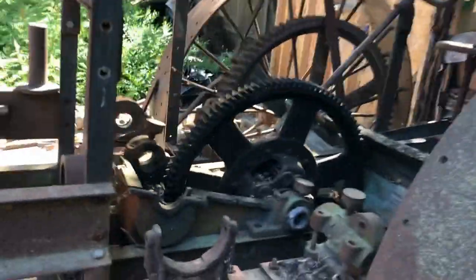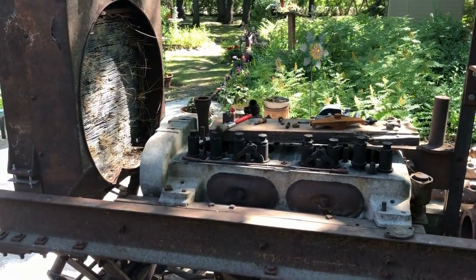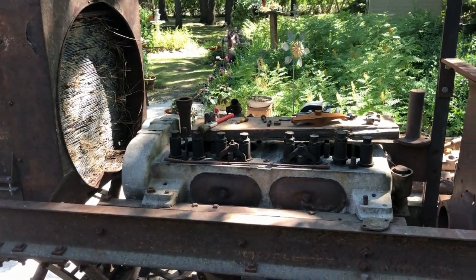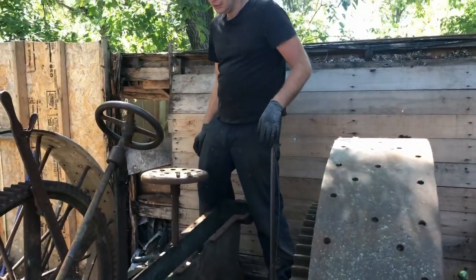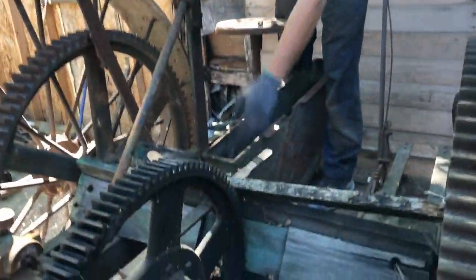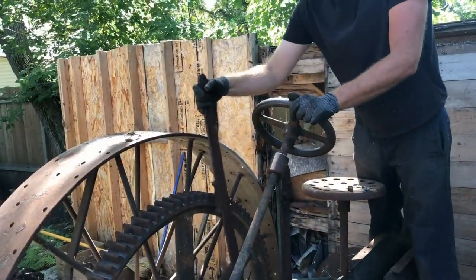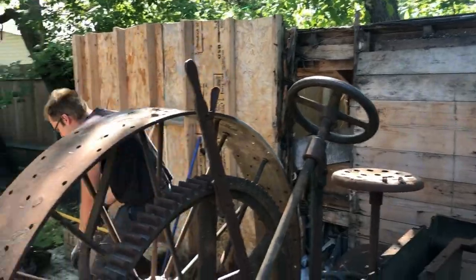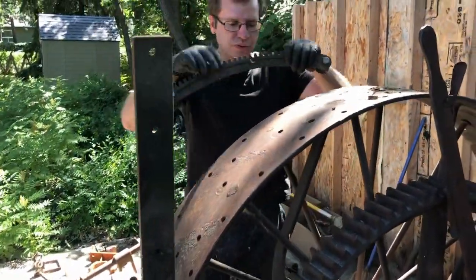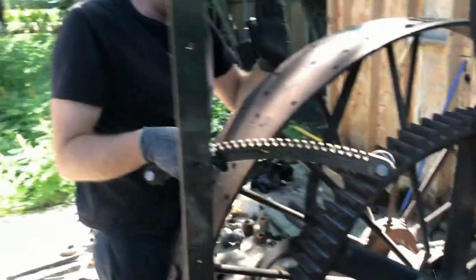You can see, everything's a little bit looser right now. The rad's not too well supported, so I don't do it too much, but you can see it does slide back and forth. You do have a segment here with seven notches. They said it was infinitely variable, but really not so much. You have your shifter here to move the gear in and out to disengage your differential. And then this one here, as your friction wears, moves over, because what it does is it catches. That guy there actually bolts on. It's off right now because it bolts onto your fender, but it would sit somewhere around here. And as your friction material wears, it allows you to move it a little bit more forward.